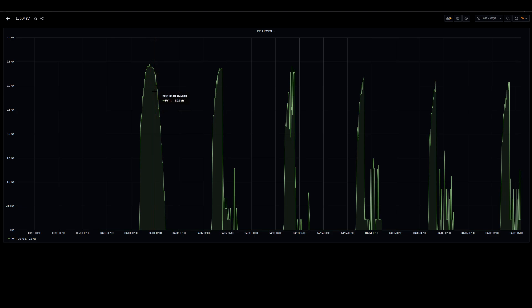This graph shows the peak power production on string one. On that day, all three strings produced 61 kilowatt-hours and the max on that day was 3.46 kilowatts. Every subsequent day has been sunny and we're expecting rain tomorrow. It'll be interesting to see how normal Georgia springtime weather — raining 10 minutes, then sunny for two hours — affects things. What I'm trying to show is soiling: how all that pollen on the panels affects production over six days.